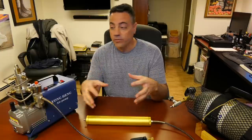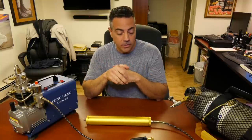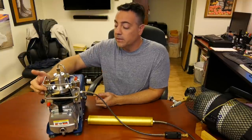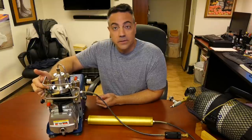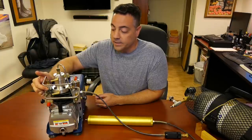These compressors — no matter what you do — high pressure compressors are going to create water from the heat buildup and condensation in the air, even if you're in the desert. Right now it's wintertime here in New York and the humidity is very, very low. The air intake comes into the first stage of being compressed and has a little filter there, but that is not going to take water out of the system.